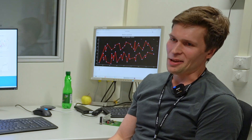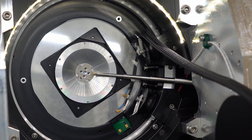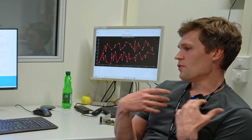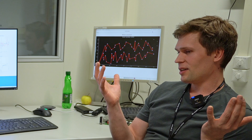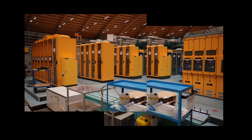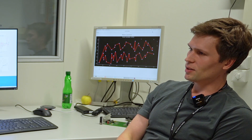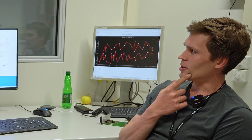So you were having problems earlier today with my microchip — can you explain the challenge? As the sample rotates it slightly vibrates, which causes problems for the 3D reconstruction. Alignment is typically based on easily identifiable features — like in panorama imaging on a phone where the algorithm finds trees or houses and matches them between frames. Here the features are lines and line edges, which aren't unique — it's hard to tell which line edge belongs to the same line edge at a different rotation angle, because they all look the same.